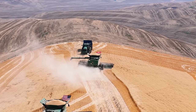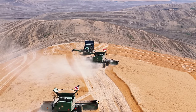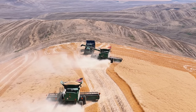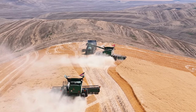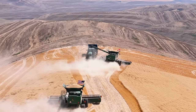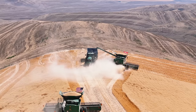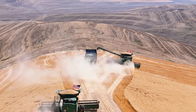They're all plenty full. And like I said, he started getting heavy. The more weight you got on there, the more you want to slide down the hill. And if you're beyond maximum level, you can't take it all the way to the top because it will slide out one side and your alarm won't go off. Same if you're going up a hill, your full alarm might not go off because you have a sensor in the front but not the back. So it could be spilling off the back onto your engine compartment. You wouldn't even know it.